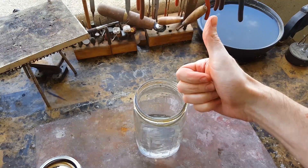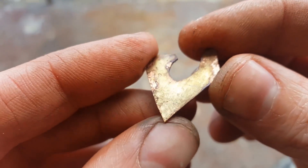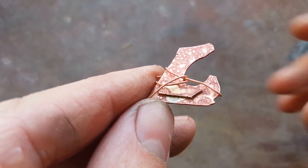This is a piece of brass soldered to another piece of brass. I'm going to have to pickle this first, and then we'll be able to use the solution we made. After a couple minutes in the pickling solution it will look like this, and we want to get rid of all this copper — that's what the solution is for.